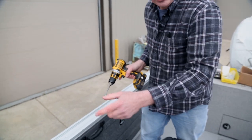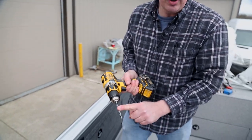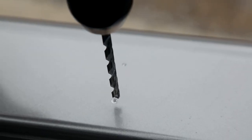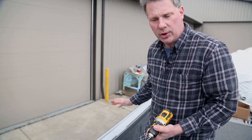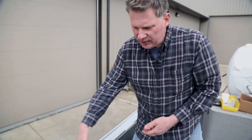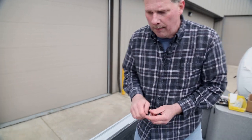Once I get all those center drilled, I can take the track off. I'm going to use a quarter-inch diameter drill bit — that's for using on hardware where we're through-bolting and putting washers and nuts on the bottom side. That's going to be on this job where we'll show you how we use our riveting system to install on this Crestliner. Before we get to all that, once we've center drilled and drilled them, I take the track off the boat. Since this is an aluminum boat, we're going to cause a little burr on the top of the hole.